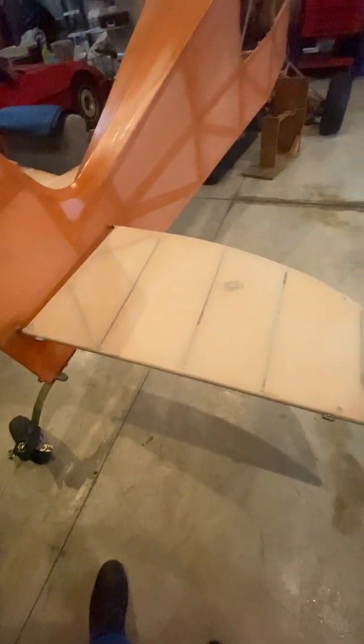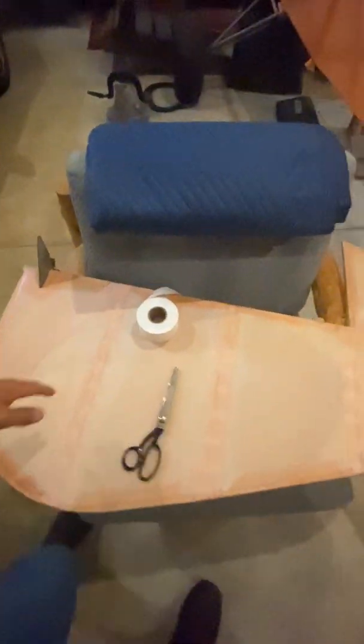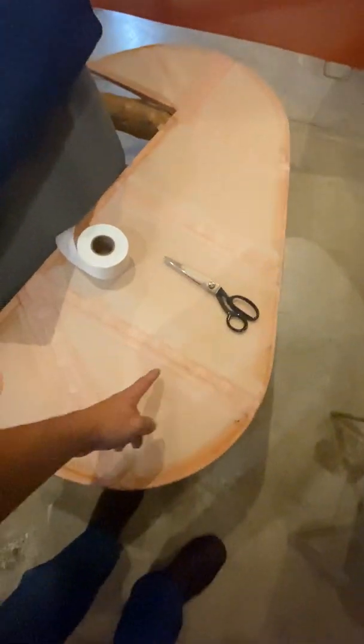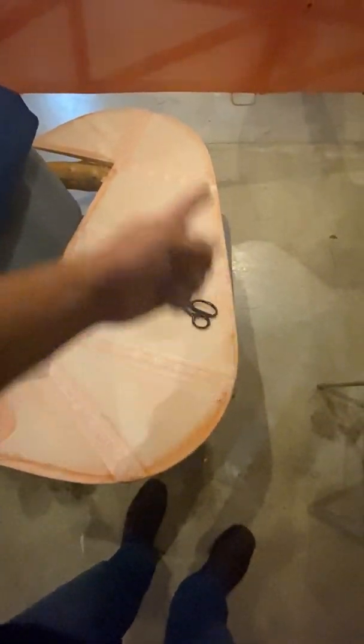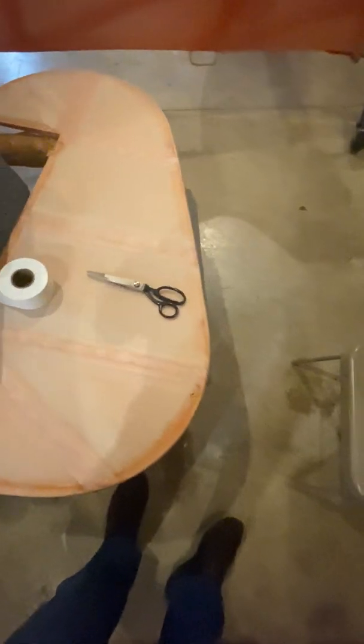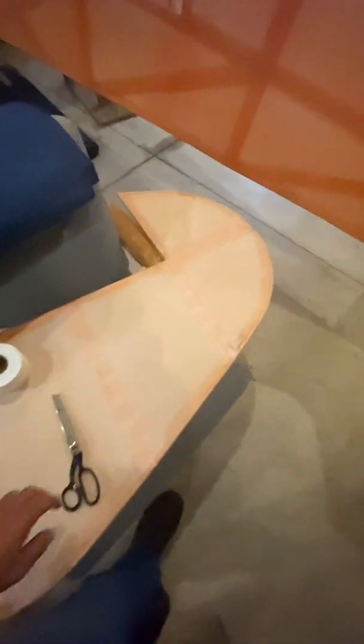I got a 6-inch Matco tail wheel. I just got done brushing on some poly brush there. I still have to rib stitch this. The rudder has been lengthened this way 3 inches, and a much better design. The tubing is twice as strong for the heavy fabric, for the larger engine.